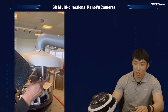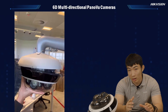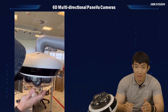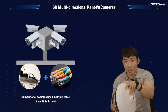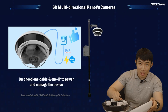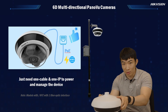If you look closely, you can install the camera just by twist and fit. You just need to make sure the little triangle on the camera is in line with the unlock sign first on the top mount. Then you twist the triangle from the unlock sign to the lock sign, then snap of the finger — the installation is done. We also made things even more convenient by making the camera PoE, so one ethernet cable will be able to power and configure the camera at the same time, which saves a lot of wiring cost for the installer as well.